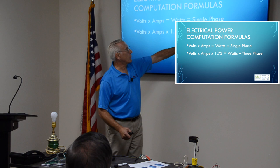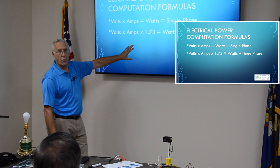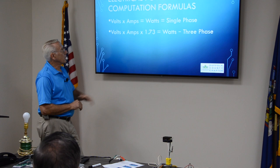Now, I know you know how to do quadratic equations, you just do the math. If you know the wattage, you can figure out the amperage. If you know the voltage, you need to know two out of the three, all the time. It's just simple math. V times A, the most common one you're going to run into is this one. V times A equals W, period. Single phase, 120 volts, or 240, single phase. Three phase is that.